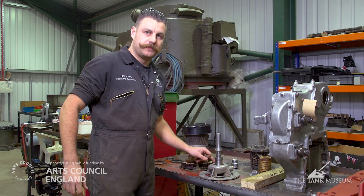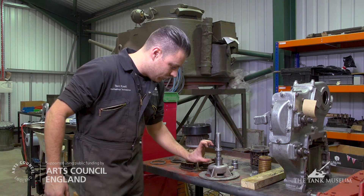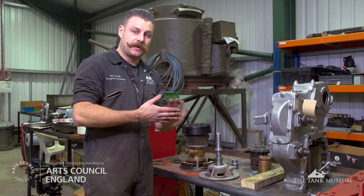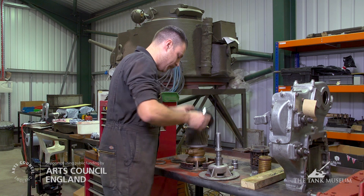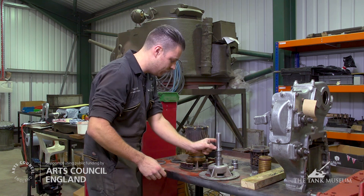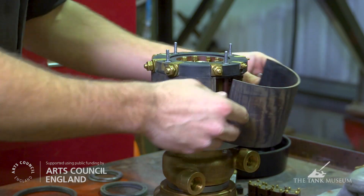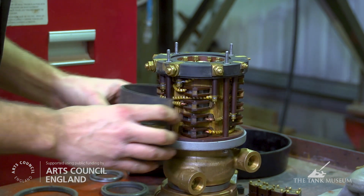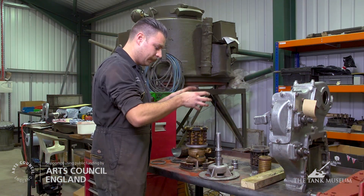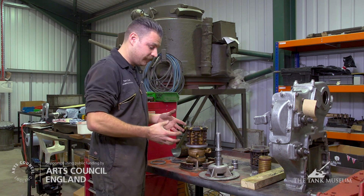Because these oil galleries run at about 300 pounds per square inch, we need to make sure that the seals are extremely tight. There was a part which has been sent off and needs to be metal sprayed in order to bring the surface back so we can get a decent seal. This one has been cleaned up and prepared as if it's to go back in the tank, presently missing its wires. Once we get our metal sprayed bit back, we can start putting our one back together, fit it back into the tank, test it, and hopefully it will work straight away — job's a good one.